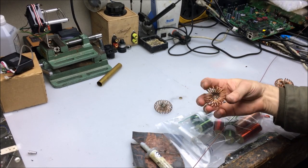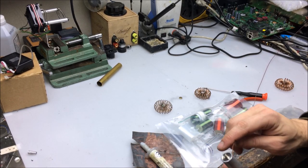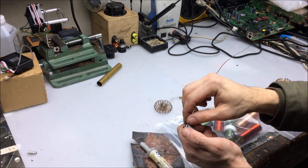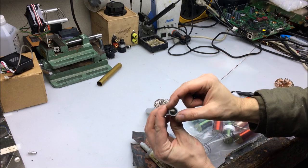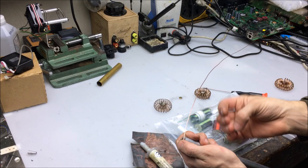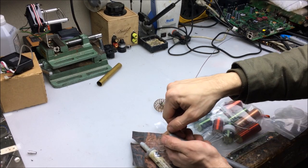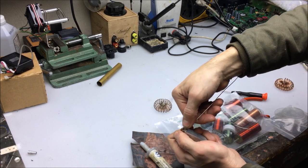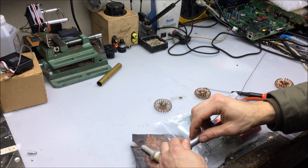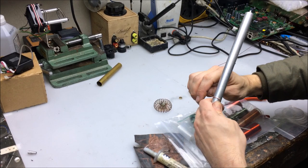Here with me is Jeremiah from Join the Technicians. So we have some 16-gauge wire here — this could be 14-gauge or 16-gauge, both those work very well for this purpose. And we have a 5/8-inch diameter copper or aluminum tube — it could be wood, it could be any type of tube, but you want something that's fairly rigid so that the copper pressure doesn't deform it. Starting out with this wire, I'm going to bend it over at a nice sharp 90, and then once again a nice sharp 90. This will give me something to grab onto while we wind this.